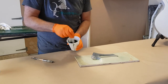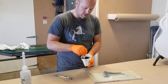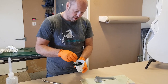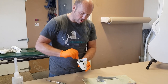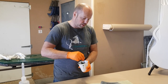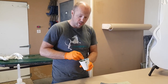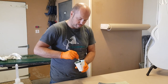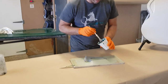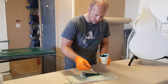Mixing up this polyester tooling gel coat using three percent MEKP catalyst. This is a special gel coat that's designed to give a really hard surface to the mold — it stops the resin from sticking to it and just gives it a really durable, long-lasting surface. Normally I spray this on, but on a small mold like this we can easily get away with just putting it on by hand.